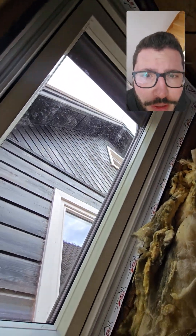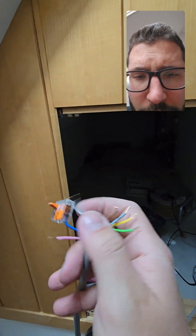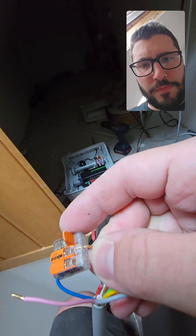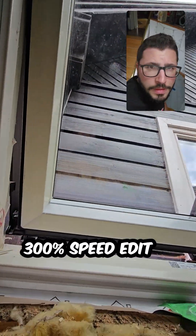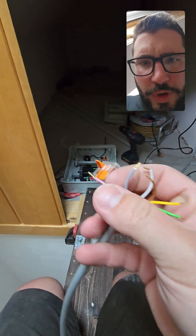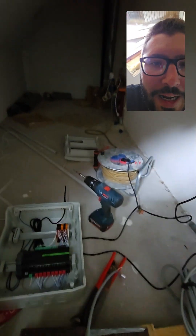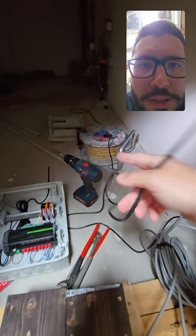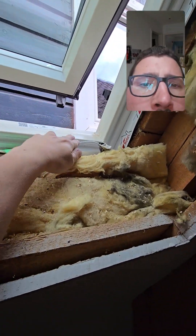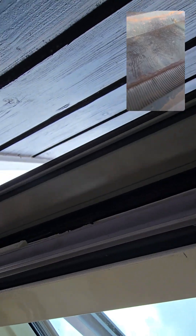I have these two windows here. If I connect the blue one to brown or white, it's open or closed. There is pink and gray — this closes the shade. The cables for each window go into this room. This is the control cable and the black one is the permanent power. Each window also has a window contact — a door contact — that's this one here.